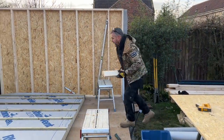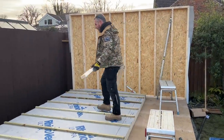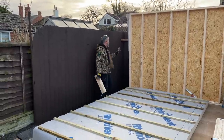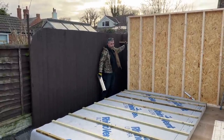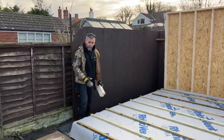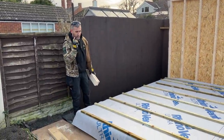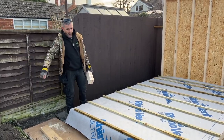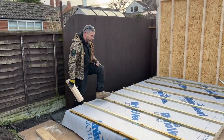I've put the vertical battens on but not the horizontal ones — when this wall comes up I want to fly the horizontal battens through and cut them off flush with that wall. Also this wall is stepped back short so the front wall can be the full length of the building, and I want the horizontal battens to fly through to marry up with it.